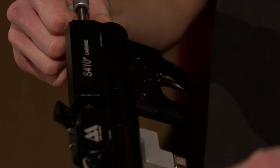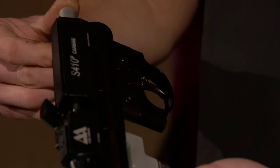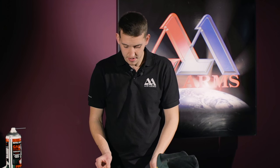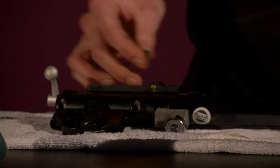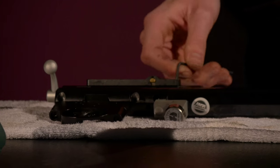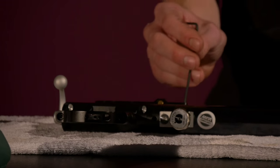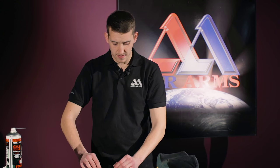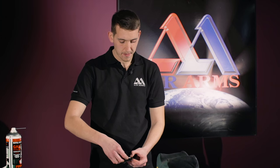It's also a good idea to remove the side plate for easier access. To remove the side plate, use a 2.5mm Allen key for the three screws. All screws are the same size, so no need to worry about position. Once the screws are removed, we can now remove the side plate and the cam, and put that to one side.